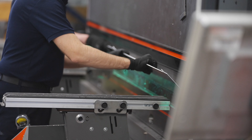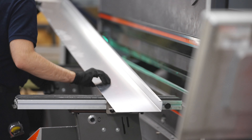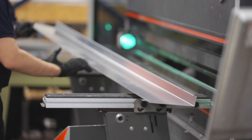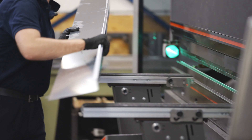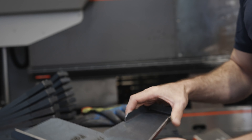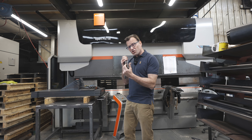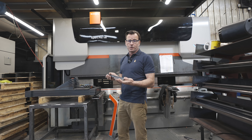This machine is called a press brake. The press brake's job is to bend the sheets of steel to form the body of the stove. This is a unique property of steel that doesn't come with cast iron — steel can be bent into these shapes, which enables you to get a maintenance-free firebox with no joints and an extremely strong body to your stove.